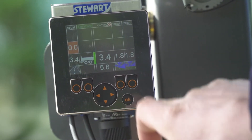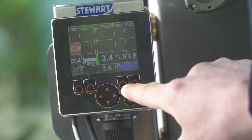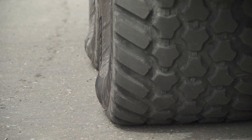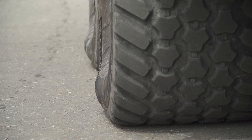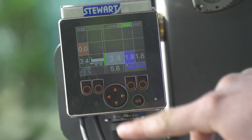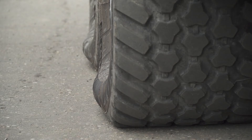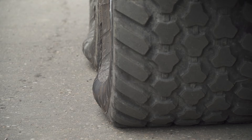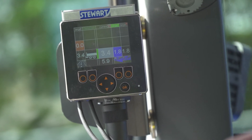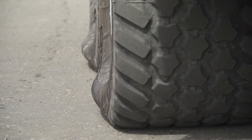So if we want to go on the field and deflate the tires, the only thing we need to do is press one button, and we can hear the hiss of the air and see the information on the screen changing. Now we have 3.4 bar and it's deflating. It will stop for a moment, measure the pressures in the system, and then deflate a little bit more. It basically needs to deflate then measure because it cannot measure while it's deflating — that value would be wrong.